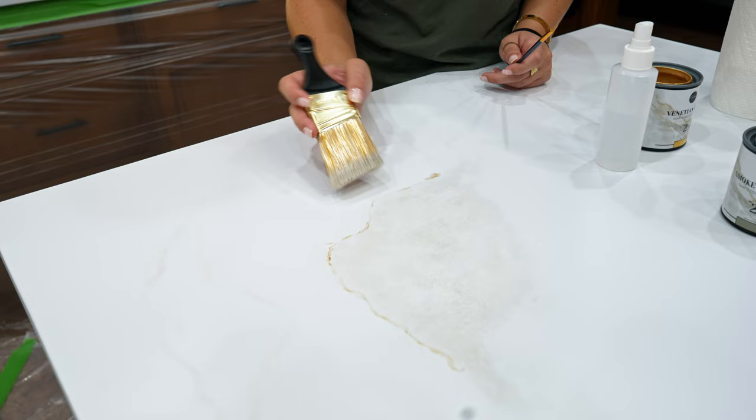If you have a connected backsplash that is taller than 3 inches, you can use the same veining technique as you would on a flat surface. But because our epoxy top coat was formulated with self-leveling properties, you must use our 100% acrylic top coat to achieve even coverage.